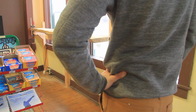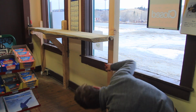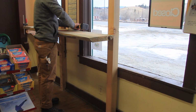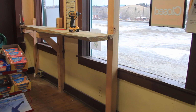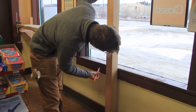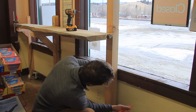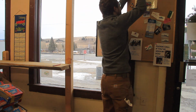And so you can see here that I'm marking out the areas where I will need to do the different depths of kerf cuts to make the different depths of dados on the backside of the 4x4. I mentioned this in the first episode of this series, but I'll be doing two different depths of these kerf cuts, 1.5 inches and 3/4 inch. The 1.5 inches will be for the apron of the window that pokes out just a bit farther than the window casing, which will be at 3/4 inch.